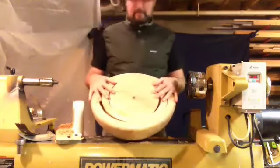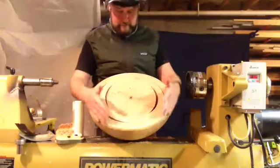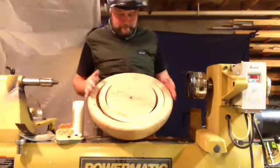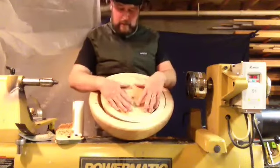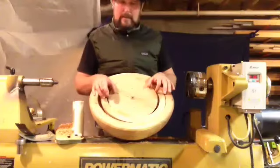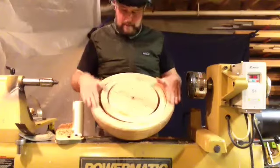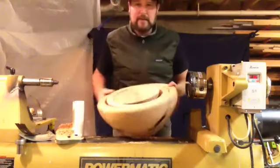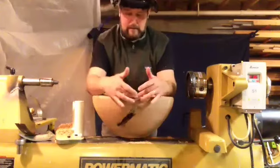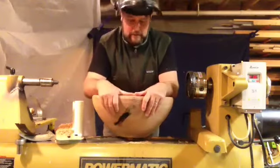Yeah. So now, that didn't take long at all, but I've got three good bowls out of one chunk of wood. Again, they are thick. This one I will hollow out before I start the drying process. Generally, I do the thickness about 10% of the diameter. That's the rule of thumb that I was taught. The outer one is probably a little thicker, but I did that intentionally because of this defect. So I'm going to try to take down the outside and salvage this one without that character.